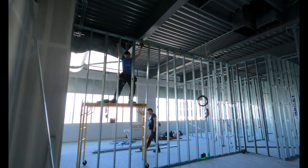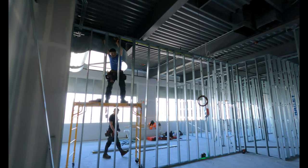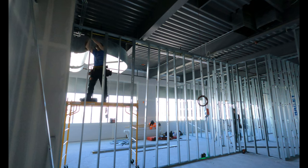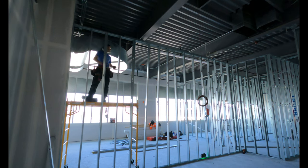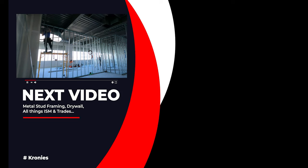He's got his 16s — you can check for plumb on your 16s. We know our steel is perfectly level, but we know this wall here is out about three-quarters of an inch — it's leaning in — so we didn't want to draw our 16s off that side. That's it, guys. If you like the video and want to learn more about metal stud framing and drywall taping, make sure to subscribe, give me a like, and share the video. We're coming close to 15,000 subscribers — I've been on YouTube since 2018 and covered hundreds of jobs. Talk to you soon, bye for now.